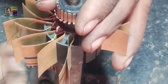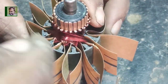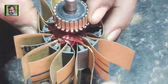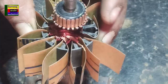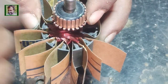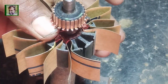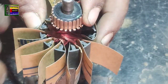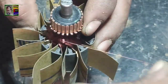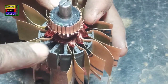It is very simple and easy. We put in the next paper and start the first coil of this slot — 55 turns. The first coil of this slot is completed and we connect the wire with the next commutator piece. Don't miss any commutator piece. We wind the second coil of this slot — 55 turns. The second coil is completed and we connect the wire to the next commutator piece, forward direction.